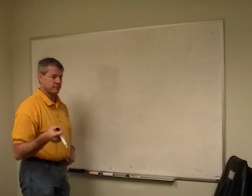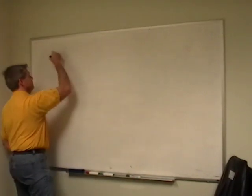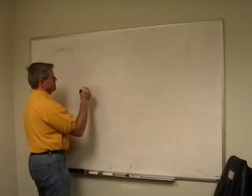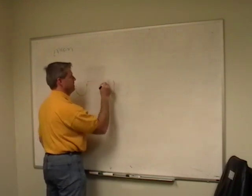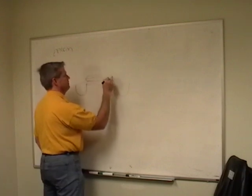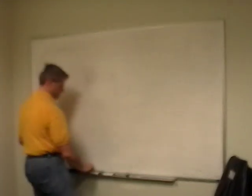electrically erasable programmable read-only memories, EEPROMs, work. I don't know if you've ever heard of those. It's kind of old technology these days. That's basically how they worked. You had your FET here. Here are your two channels. Here's your FOX. And there was a floating gate and another field oxide. Maybe I should draw this in red.